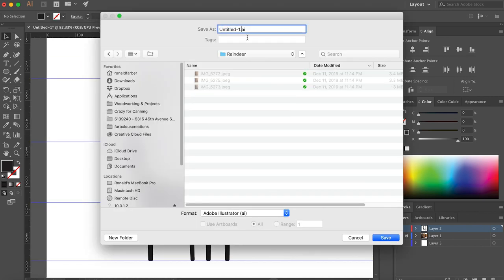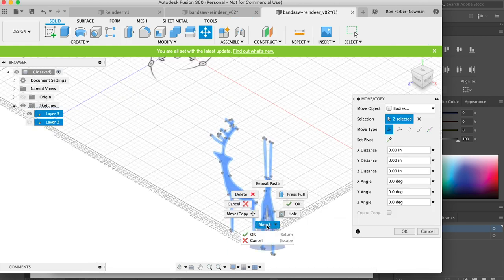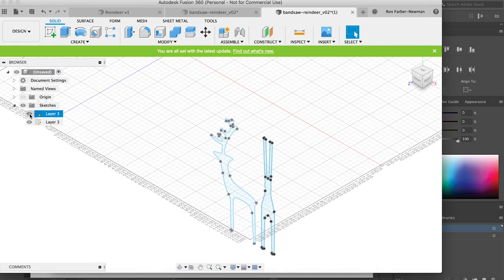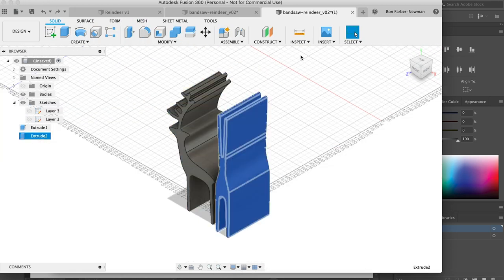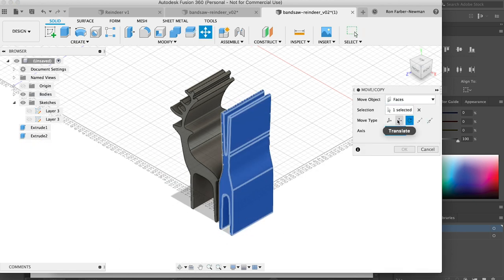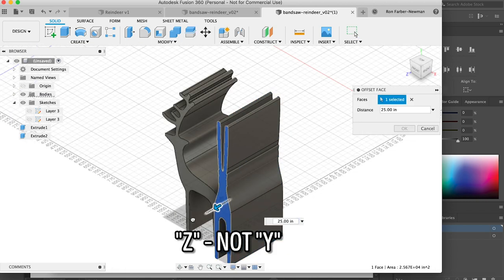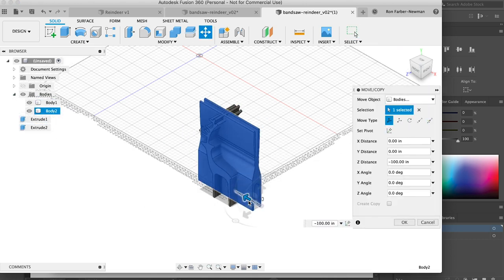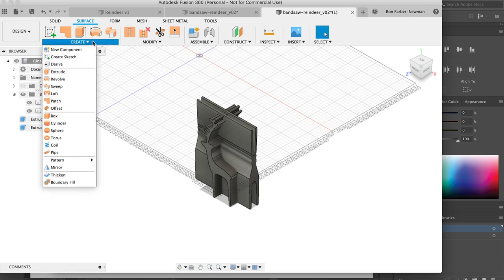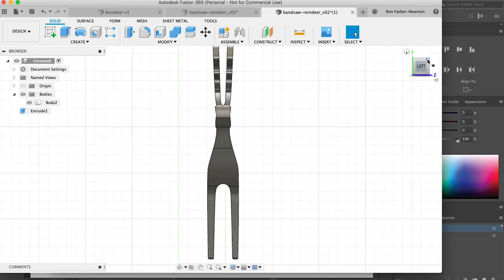Now it really didn't take long to make the template from the photos, but I wouldn't know if it created a truly successful 3D solid until it was cut out. There was a way I could test the template out without wasting wood, and that involved extruding my template shapes in a 3D drawing program. I've mentioned in a previous video how I really want to learn Autodesk Fusion 360, and I figured it would be up for the task — specifically how to take extrusions of each profile, one in the X dimension and one in the Y dimension, and then do a boolean operation to only show the areas where the two shapes intersected, the exact same operation you effectively perform on the bandsaw. I was delighted to realize that my profiles would indeed create a viable shape on the bandsaw once cut out of wood.